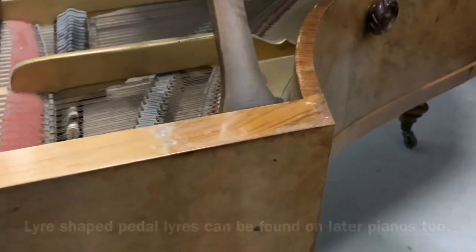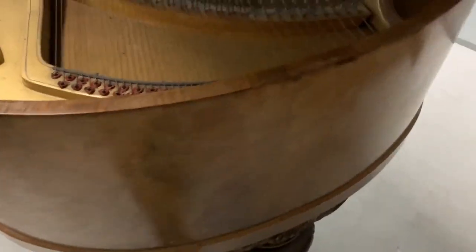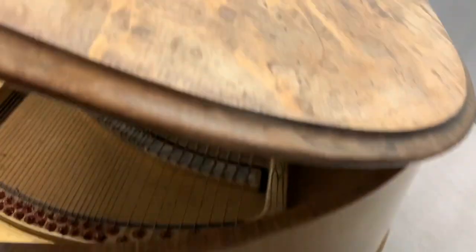It's faded quite a lot as you can see. If this was re-polished it's a stunning looking veneer — that could be done. If we re-polished it would be a little bit darker, but we'd still go for a lightish colour to get the most contrast in the grain. The top of the piano has got a bit of damage, but it could be disguised if we French polished it. French polishing takes about 70 hours, so it's costly, but the instrument is exceptionally well designed.